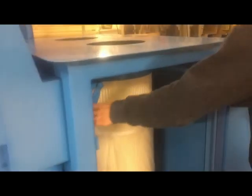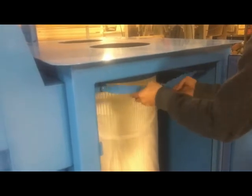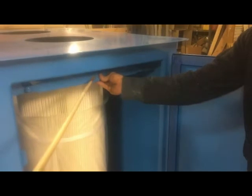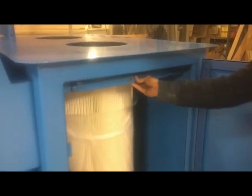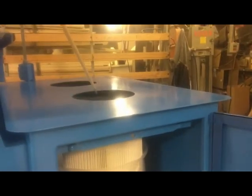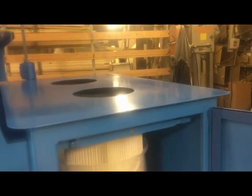Now go ahead and pull them in. Now tighten up the filter. You just pull these in together. You have a hole that lines up right there, and there's a bolt that inserts into there that locks them in place. And this is all set on an eccentric. And that way, when you turn those handles, that raises them filters up and locks the seals against the inner plate that's up on the inside of that hole there.